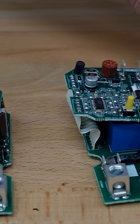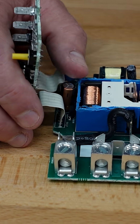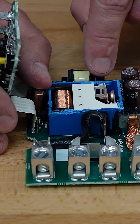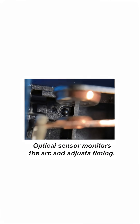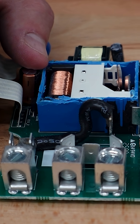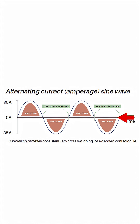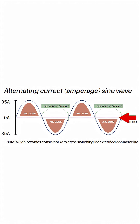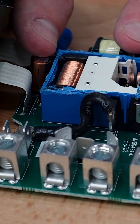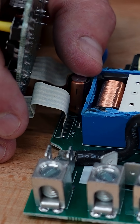Let's take a look at the inside. Here you can actually see the contacts. What makes these contacts last so long? First, they latch open and they latch closed, which also reduces the possibility for chatter and arcing. But the main secret is there's actually a little eye on the backside of these contacts that looks at the points and can tell when there's an arc. Depending on the size of the arc, it can calculate whether it needs to change that open and close time slightly in order to hit what we call zero point. Zero point is the point in the sine wave where it's crossing zero — if it opens and closes at that point, you get no spark. It really is that spark or arc, caused by current moving through it, that causes these points to wear. If it opens and closes at or near that zero point, it's going to greatly increase the life of the contactor, which is a key aspect of what makes the SureSwitch really special.